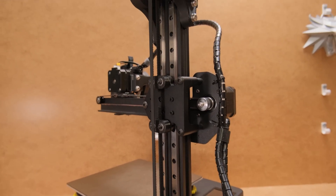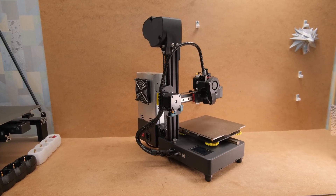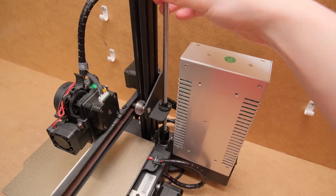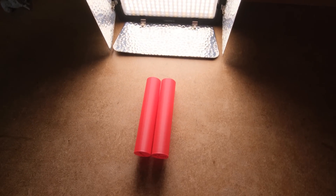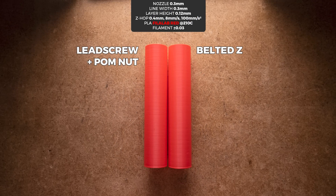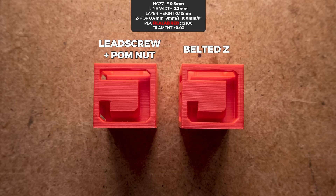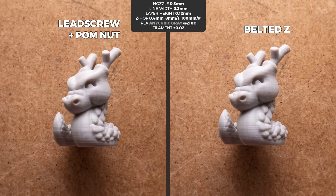Now that looks absolutely sick, but I think most of us care about the actual print quality. So how does a mod like this stack against a lead screw with a POM nut that had a perfect alignment? Keep in mind that all the prints will have lighting angles to expose the irregular layers the most. The first print is a basic cylinder in vase mode and right off the bat it is very hard to spot a real difference. I would say maybe belted Z looked a little bit better, but it is such a minimal difference. But here is where things go sideways. The Mach cube print looks worse — I would even say the results here show a noticeable difference and it is impossible to make a wrong blind guess. Meanwhile, the Cali Dragon print results look more or less the same, but they still slightly favored the regular lead screw with POM nut combo.